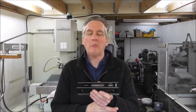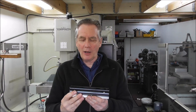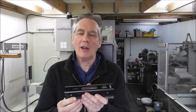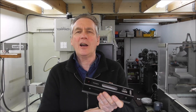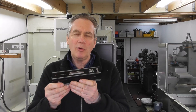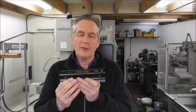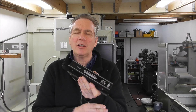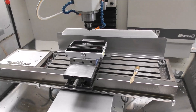Hello again, it's Cliff here from down under. In this video I want to try out this new precision machine level that I bought a year or two ago that I haven't had a chance to use yet. I'm going to clean out the X and Y axis slideways on one of my 1100s, adjust the gibs, and see whether the base casting that houses the Y-axis is twisted with this machine level — a bit of maintenance and discussion about using a level on your machine.